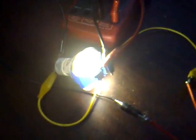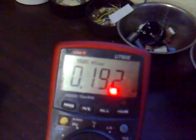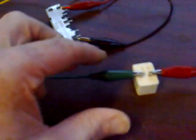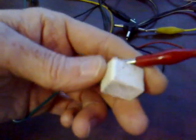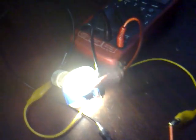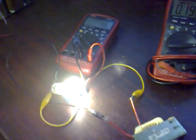This light meter has made it really easy to see if any changes to the circuit improve things. I've got mains brightness on 8.5 volts and 192 milliamps, so I'm quite pleased with this. I may use this in other oscillator circuits because it's tailor-made for pulsing transistor bases — we might be able to do something with exciters as well. This is the best results I've had to date with lighting these LED bulbs. Thanks for watching.